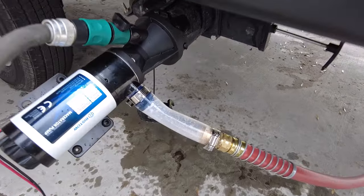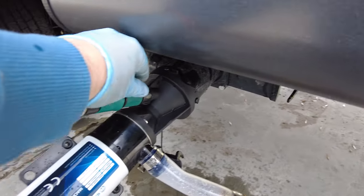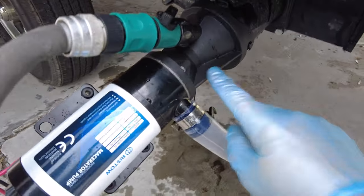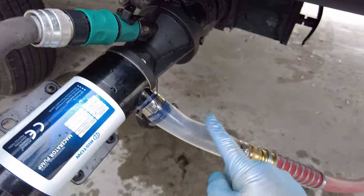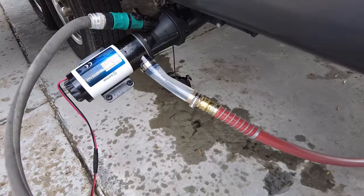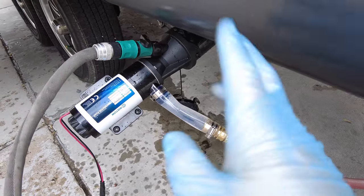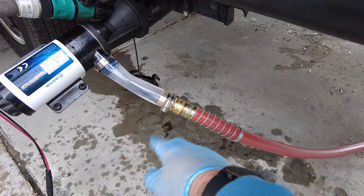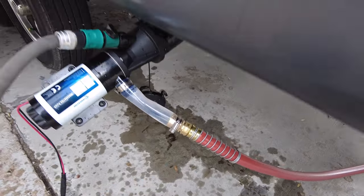When it looks like we're empty, I'll go ahead and shut the valves and then open up the rinse hose. This water from your rinse hose goes into the pump — since your valves are closed — and helps rinse out the pump and the hose. I let that run for three to four minutes to give a nice flush. Once you're done, shut everything off and you're free to disconnect. Even if you spill a little water when you disconnect, it's okay because it's all fresh water in the system now.